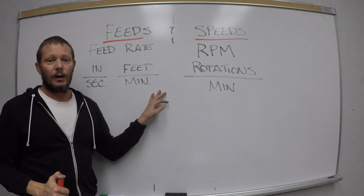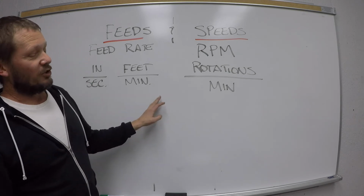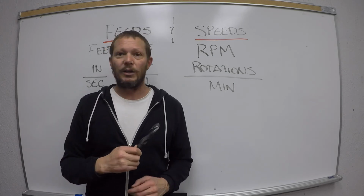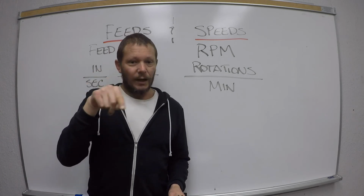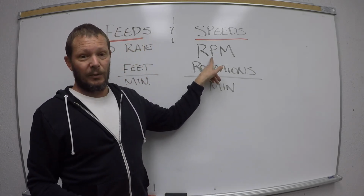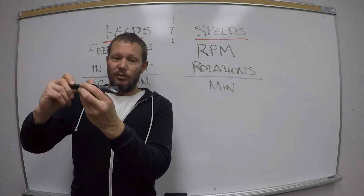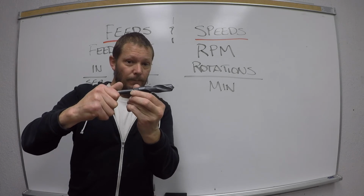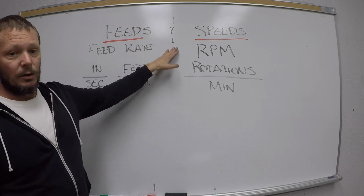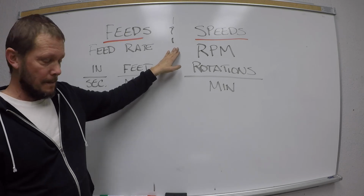Now there's an equation for this, and it's very simple. I'm not going to give it to you right now. I just want you to maybe rewind the video if you need to, but just sort of wrap your head around what's happening here. We want to drill a hole. We want to cut wood. You want to use a circle saw, the portable circle saw. That blade's spinning at a certain RPM, and you're pushing it, and that's your feed rate. The drill bit's spinning in the drill, and you're pushing it, and that's its feed rate. In machine shop land, that's what's known as feeds and speeds. This, I cannot stress enough, is the name of the game. Period.